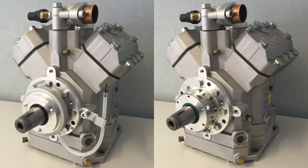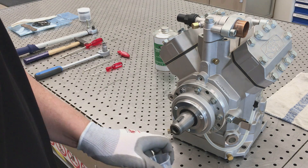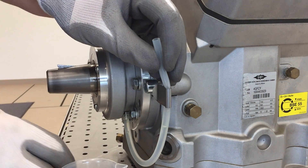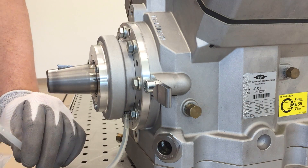There are two different sealing covers in our compressors: the new one with an oil collection chamber and the old one without an oil collection chamber. For compressors with an oil collection chamber, before dismounting any part, fully drain the oil stored in the oil collection chamber.